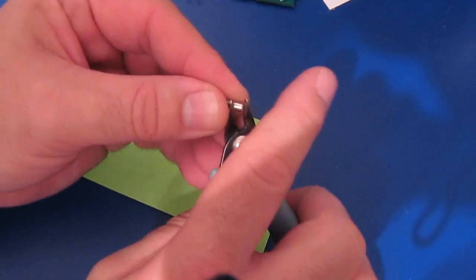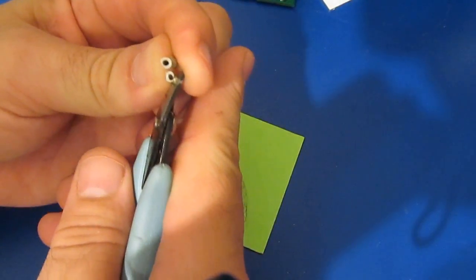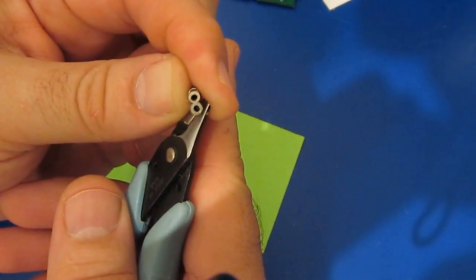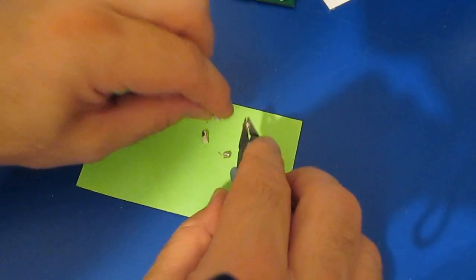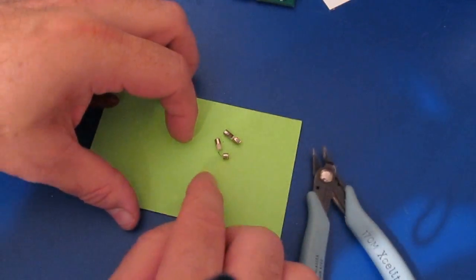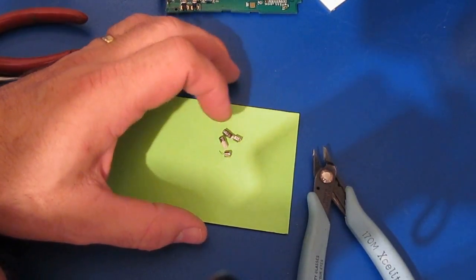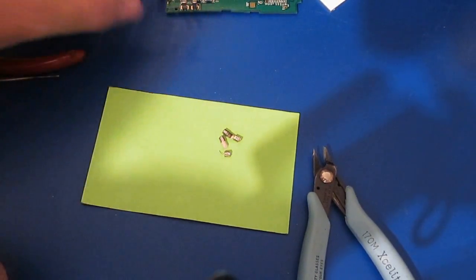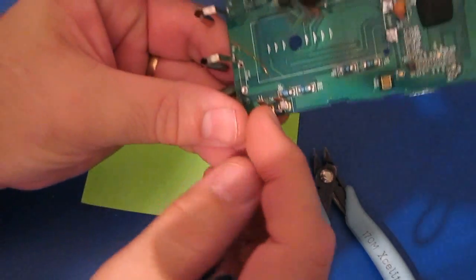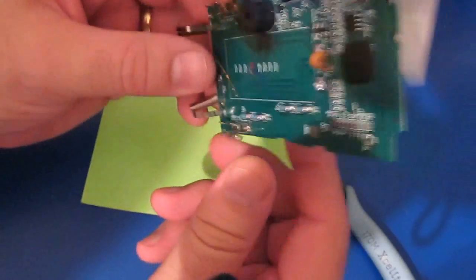Let's have a look at the 600 milliamp one. Yep, same thing. See, no fill at all. So yeah, these are not safety fuses. And again, I wouldn't have expected these really to be filled, just with the body size being so small. You know, I already know that it's going to arc right across the two fuse contacts, even without a fuse.